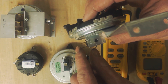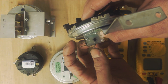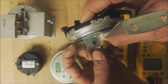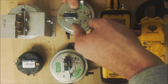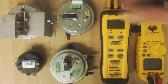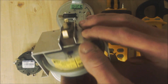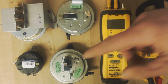This right here is the normally closed contacts and these are the normally open contacts. Most manufacturers use the common and the normally open ones. As soon as the inducer motor turns on and gets to the proper negative pressure reading, the normally open contacts are supposed to close, allowing 24 volts through to either the ignition control module or the gas valve. This one does not have a negative inch water column reading on it, so you have to look up that model number or do your own test if you have a manometer and pump.